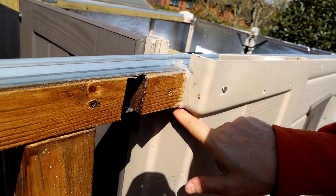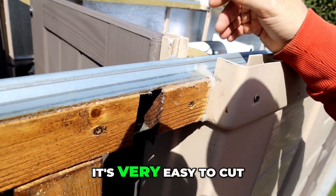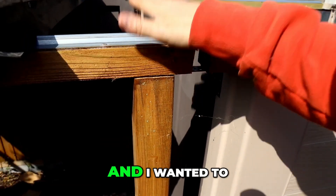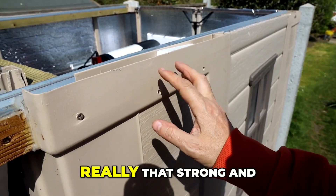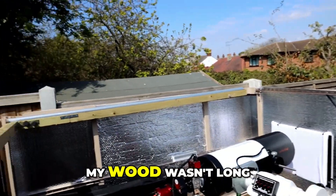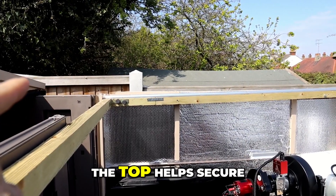This is one of the cuts that I made. I worked it out roughly with a smaller piece of wood, cut down to get the angle, and then just cut it with a saw. Very easy to cut, and I made sure the angle was slightly down away from the observatory. I put in a reinforcing piece because the plastic isn't that strong and I didn't want too much weight on it — you can't screw wood into the side effectively. The rail is three metres in length so I had to join two bits together, and the same goes with the wood. I've butted them together with steel plates either side just holding it together, and the rail on top helps secure that as well.